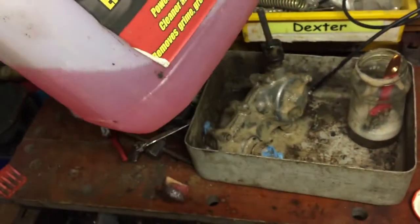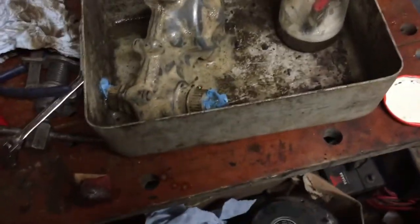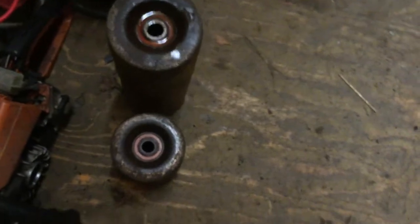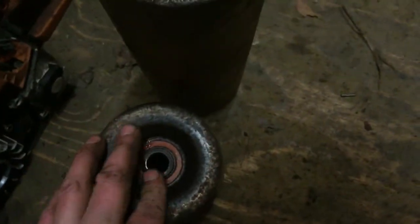It's water-based — Gunk Ultra Engine Degreaser. It doesn't smell too much. The old traditional Gunk stuff really smells and is overpowering in a shed, but this one doesn't have a very strong smell at all. You just brush it on, leave it on for a while, then hose it off and it clears it off — sometimes you have to give it a second go. I've cleaned the roller and put a bit of WD-40 in there just to aid cleaning. The bearings are okay — in an ideal world they could be replaced but there's no much play in them so I'm going to leave them.